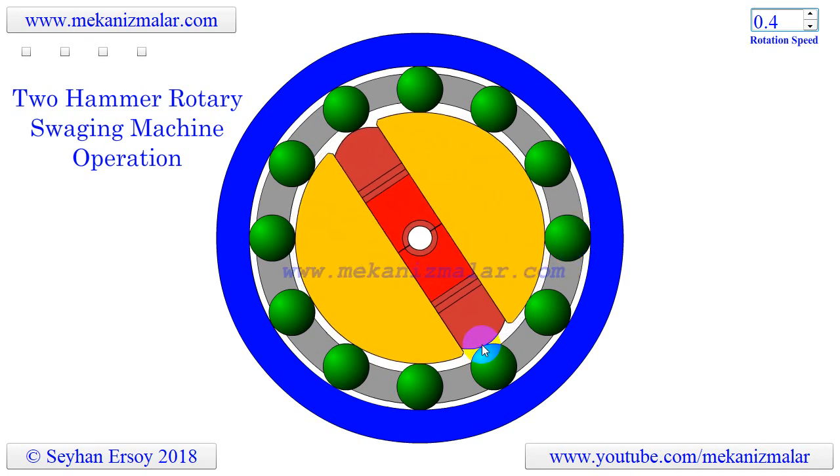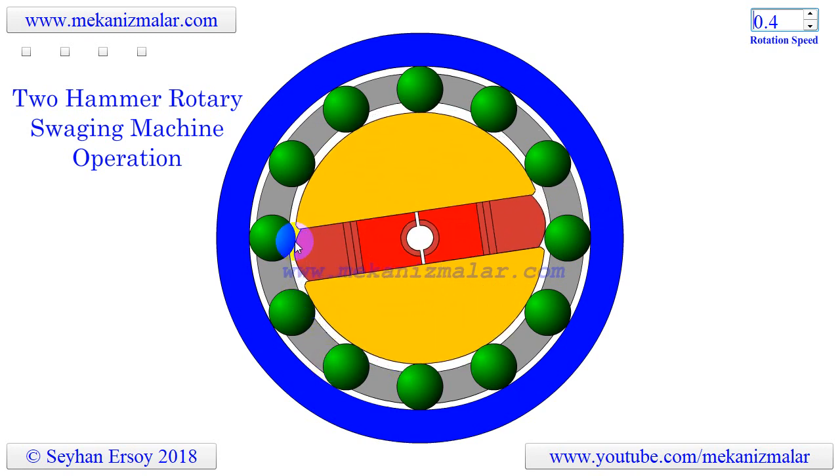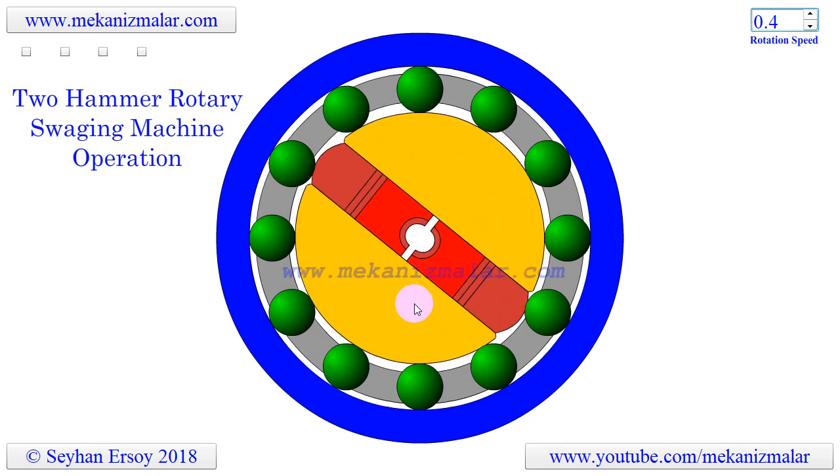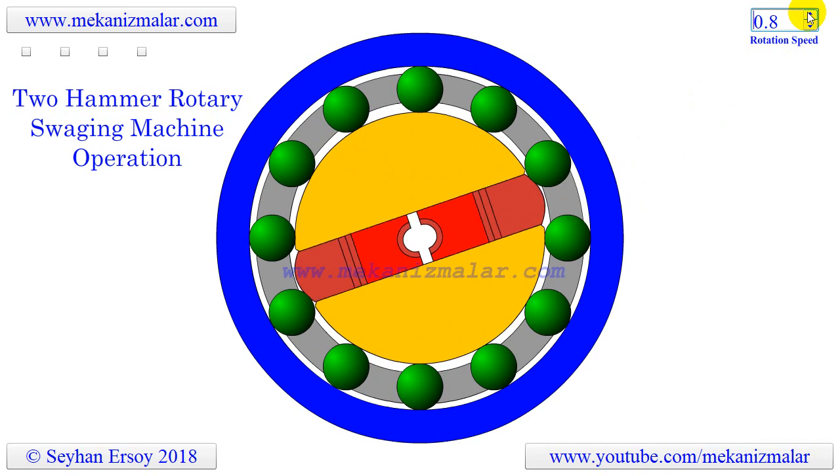When the dies cross the rollers, they push the dies together due to their large size. Like tube swaging, rotary swaging can also create internal shapes inside the tube through the use of a mandrel, as long as the shape has a constant cross section.